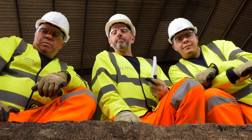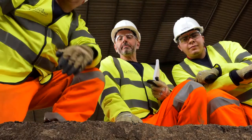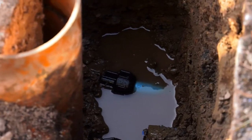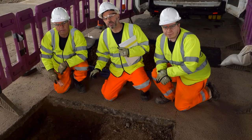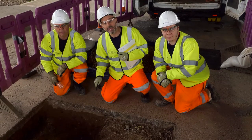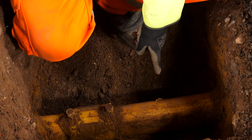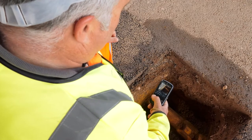Remove all rubbish and debris from the excavation and store in a designated place. Also remove any standing water. Check for signs of water contamination and report to your supervisor — we need to remove the water because full compaction of the material won't be achieved. If there are shallow cables, take photos and report to your supervisor. If there is any undermining or damage to the apparatus, or if there is a void, take a photo and report to your supervisor.